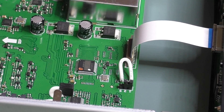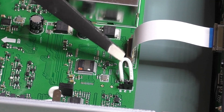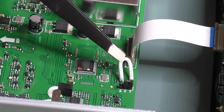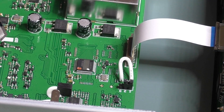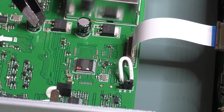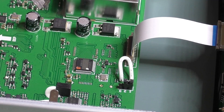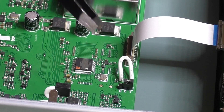There are a couple of things we can do to mod this radio. Firstly, if you look at this white wire here — if we were to slice through and cut this wire, this will change the radio into 10-meter mode. We would lose all of the CB frequencies, but the radio would then be purely in 10-meter mode and we could adjust to high power. We don't want to do that because we want to maintain the CB frequencies.